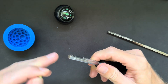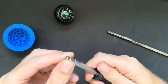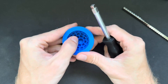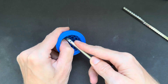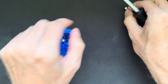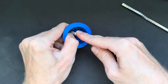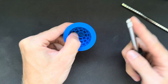I take one of the magnets off and put it on a screwdriver that has a flat top. Double-check with the compass — we see south pole here, which is correct. I always start with the inner circle first, so the first magnet is easy: just push it inside like this, and you have the first magnet in. Then continue.